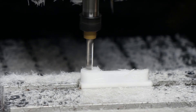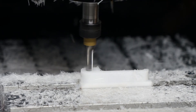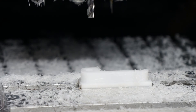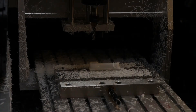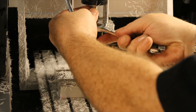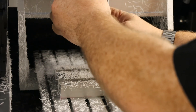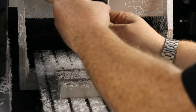Okay, drilling operation. I did it with a heavy peck because I was trying to avoid the material sticking to the bit. Next cutter change — eighth-inch cutter with a finishing pass.